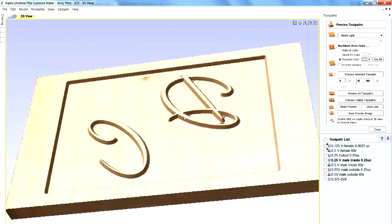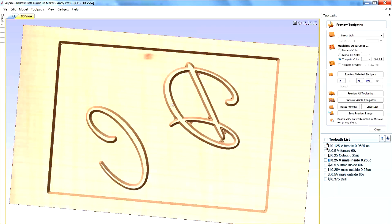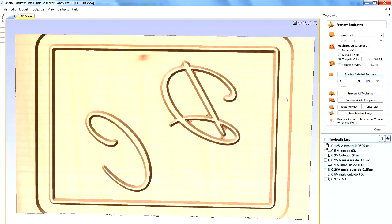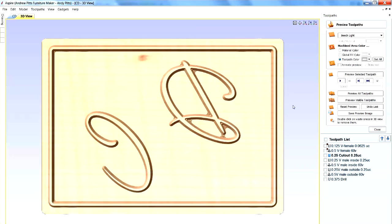Okay, so all that's cut out now. So if you look at that, you see I have the raised letters, and if everything's done right, the flat on this raised letter is going to totally bottom out in the flat of the maple base part. And now I just got to get the outside of this machined. So I'll use a 60-degree V-bit, another 1/4 inch end mill, and now you see I've got all that machined out there. And just to make sure that I'm not going to run into my screws that are holding this down, that's where the screws are going to be. So they're well outside the path of the bit. And the final step is to do a cutout where I cut away the waste. So that's the inlay part. So I take that part and I will inlay that into the cutting board itself.